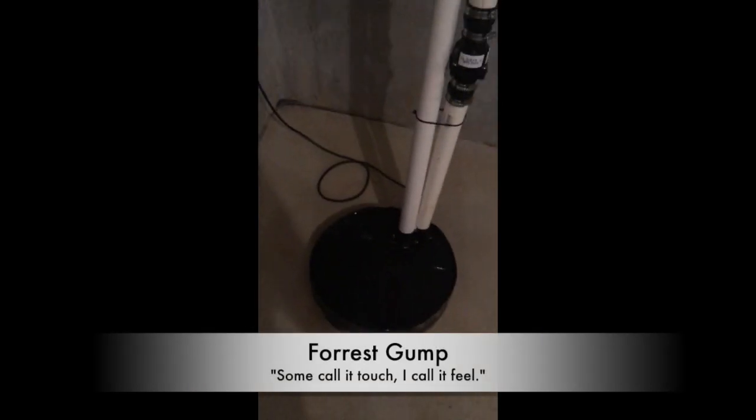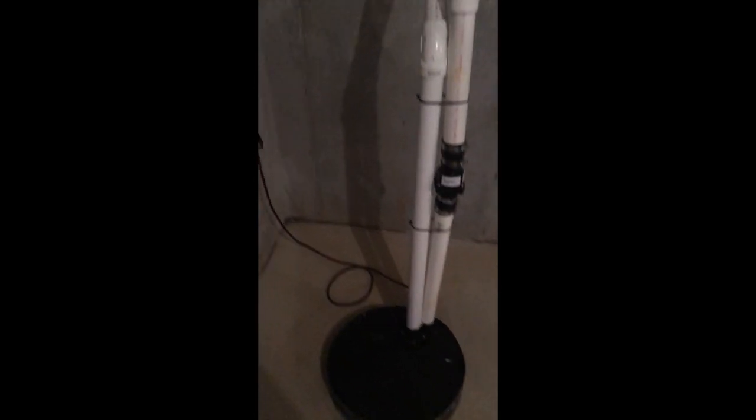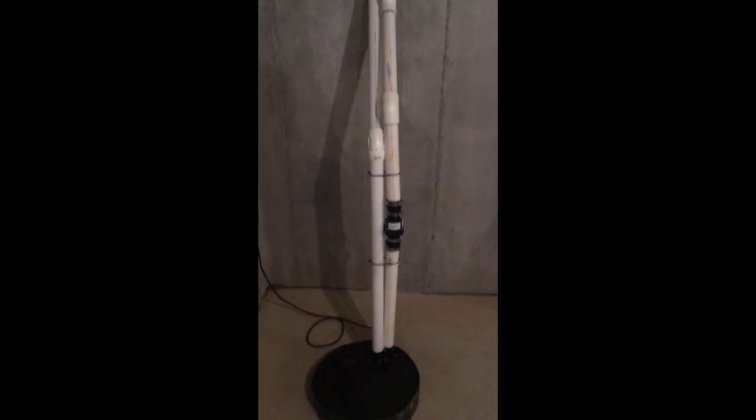Other senses you want to use — you want to use feel. When I pop to the top of this sump pit right here, I can actually feel wind coming back at me. There's a drain tile emptying into this sump pit, so that could be a reason for the escalated levels. 44 is pretty darn high.